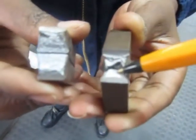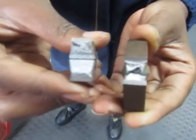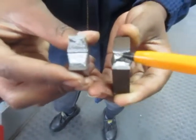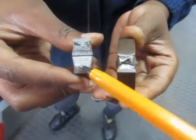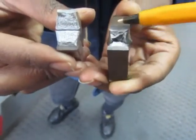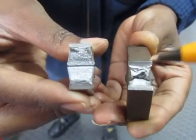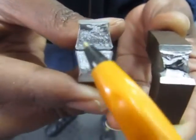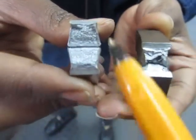So it's more tough. Because remember, when you're doing the impact test, you're trying to find the toughness of the material. So that is tougher compared to this one — shiny and brittle versus dull and tougher. This one I would say is something like 85 to 100% tough, and that one is something like 40 to 50% tough.